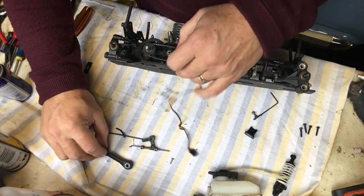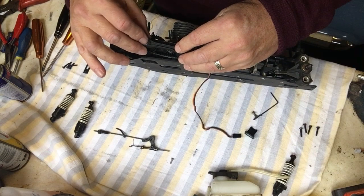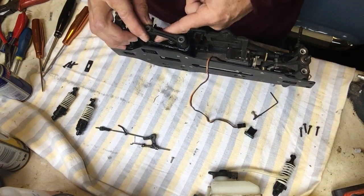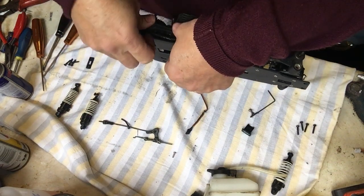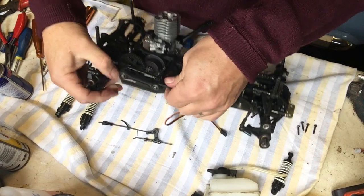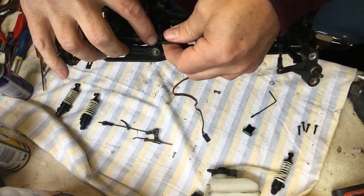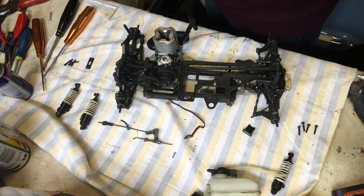And then all we need to do is take this, the bearings go on the inside, the washers go on the outside, we clip it into position, and this should provide tension to the drive belt when it's in position. There we go, just like that. And then it's just 2 circlips that go onto the front mountings here and here. Oh dear, then here and here. So let's give that a go. So I'll find the 2 circlips that go in there.